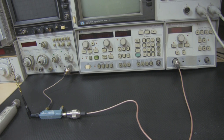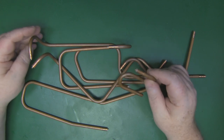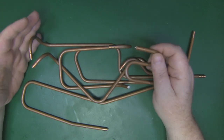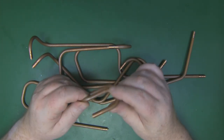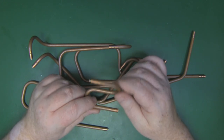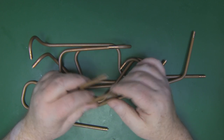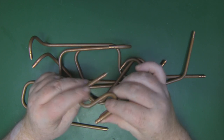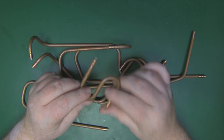Let's get over to the bench and take a look at what we've got to work with. To form the basis of the jig I'm going to use this rigid coax that I picked up — a whole box of it, pretty cheap. The seller told me it's rated up to 18 gigahertz, and more importantly it's 50 ohm rigid coax, which is what we need. 18 gigahertz is far more than what I work with, so it should be more than capable of handling the 2.4 GHz and 5.8 GHz that I use.